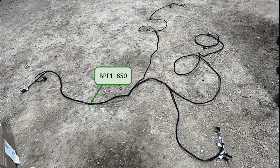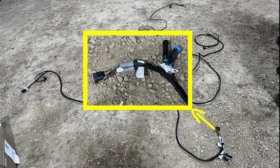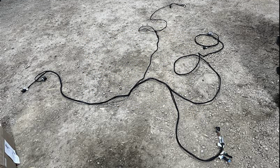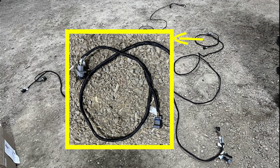For machines that are not Green Star ready, an adapter harness will be needed. The displayed connectors are used as service advisor port and corner post connection power. These connectors are your constant power, CAN implement, switch power, and radar/implement switch. The eyelets are used as battery power, switch power, and ground. The last connector is used to attach your Starfire receiver.